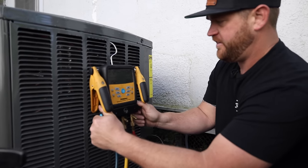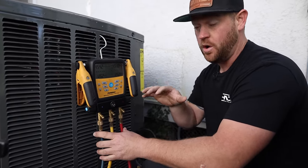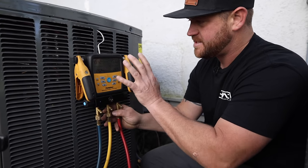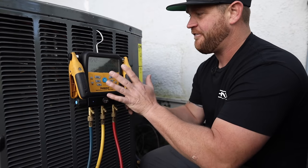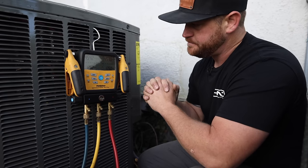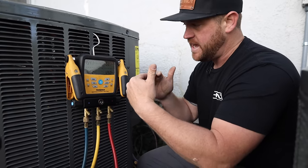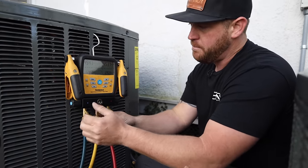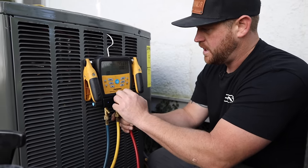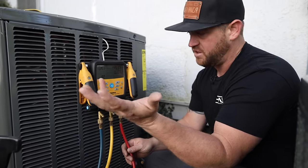All right, so I got it at 452-453 psi now. The system is rated for 480 psi on the low and the high side, so 450 is a good number. I'm going to let it sit for probably a minute just to let everything settle out before I actually start the test tightness feature. Because with temperatures being different inside versus outside, it may take a moment for everything to stabilize. But it looks pretty good now, so I'm going to go ahead and hit the test tightness button, hit enter, and it's going to start counting down and let me know what the pressure difference is over 15 minutes.